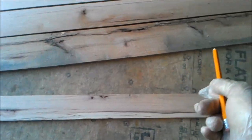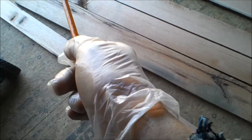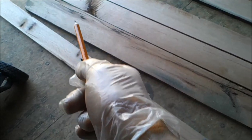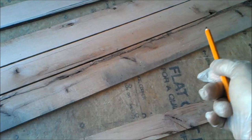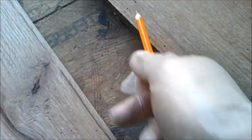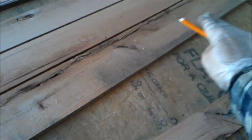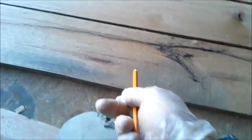This piece has some weathering — it's set out and looks kind of rough now with the graying. It is also a quarter-sawn board against the grain along the pith, so there are a couple of two to two-and-a-half inches along that edge that are not really usable. But if we can run this through the planer, we've got some natural wormy holes — some of you are familiar with the wood I've been using — and that will add character. If we can work between this knot and this knot, there's a very nice piece. This one will make for some very beautiful upright pieces because you can see the flecking in the quarter-sawn — that might make the vertical uprights.